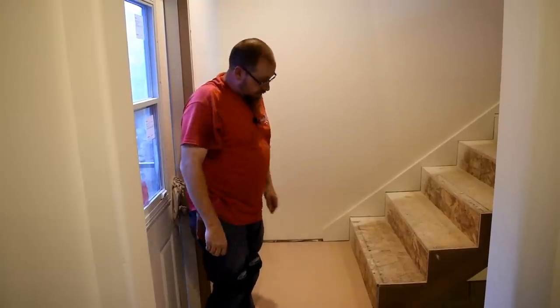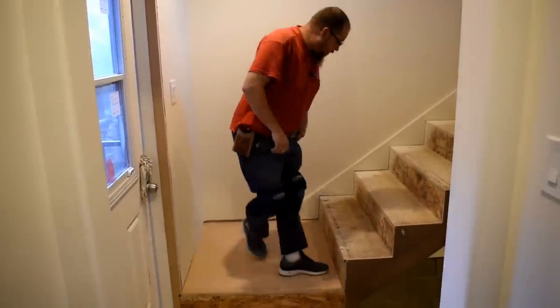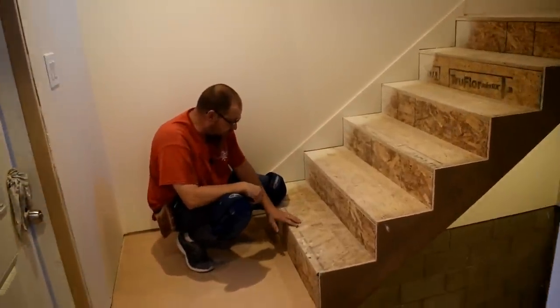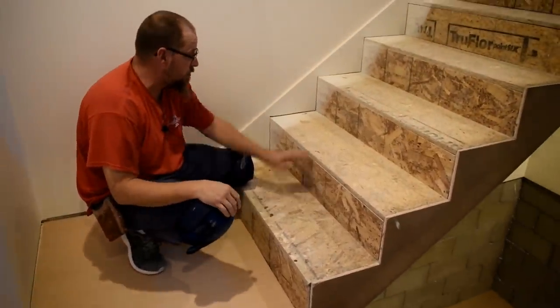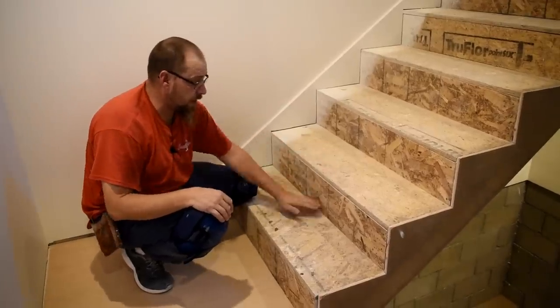So today we're putting some LVP on some steps, and because this is a chip board, I am putting an underlayment on it. That way it's smoothing it out, because this is just too rough to put a glue down product on it,